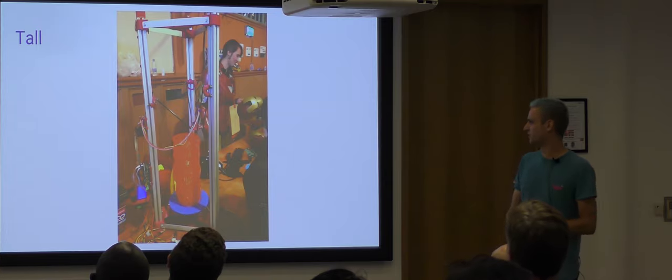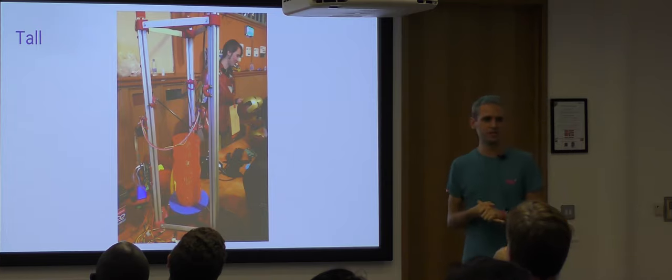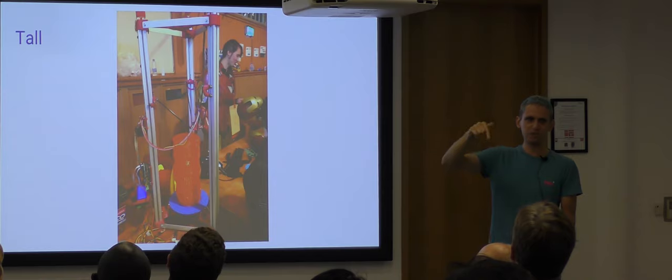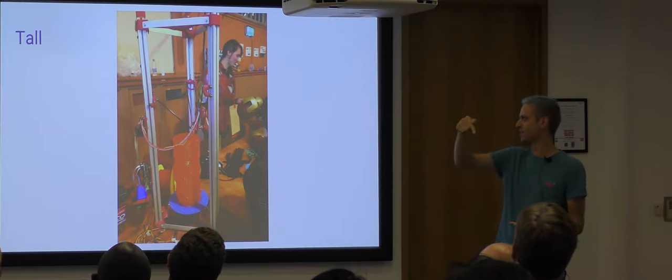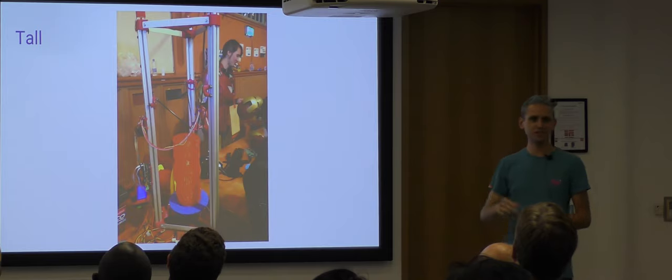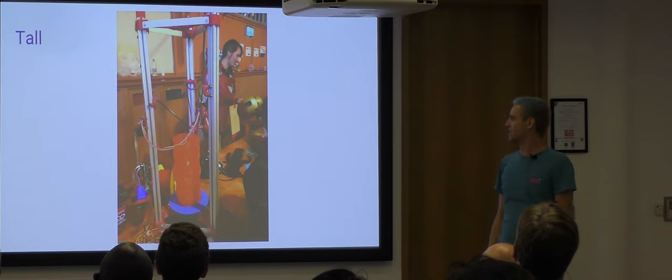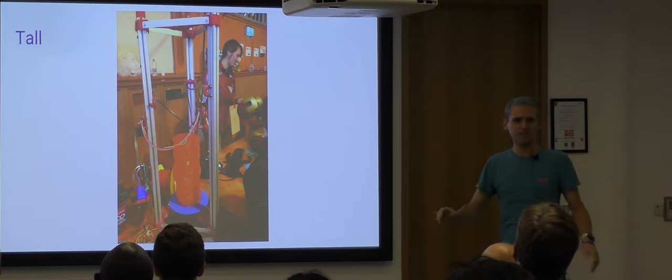And we printed this one in the spiral vase mode. I don't know if anyone has used that mode before. It's just we print one perimeter in a spiral gradually going up. So it's a bit like a helter-skelter, and it just keeps going round and around in one continuous path. That really kind of shows off the deltas really nice, because the arms are all going up and down into their extremes. So it just looks quite good for a solid 6 hours without you having to touch it.